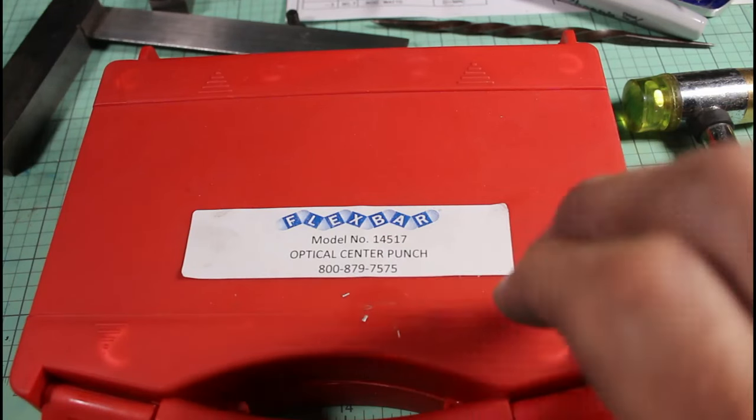Okay, so now I'm going to mark this off a little bit for the pulley. And the pulley is going to be right at the end here, and that's about a quarter inch diameter there, so let me just set that up. Right there, so I'm going to follow in from the original cut right there, and that's where the total width of the V will be. So then I figure I'm going to use a parting tool to get in the first part of the cut and wing it from there.